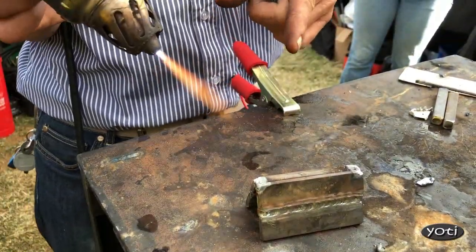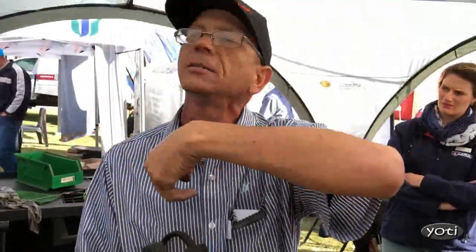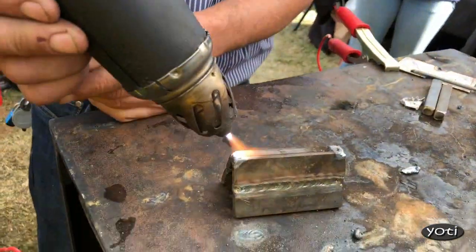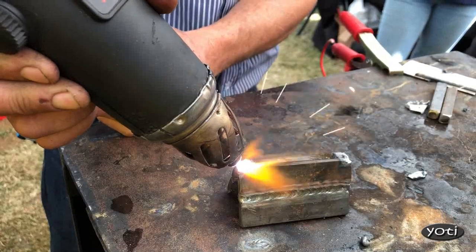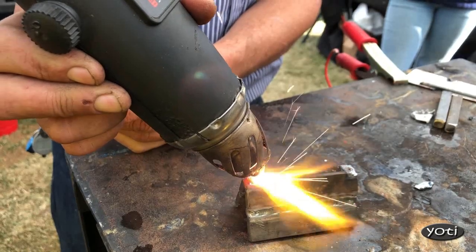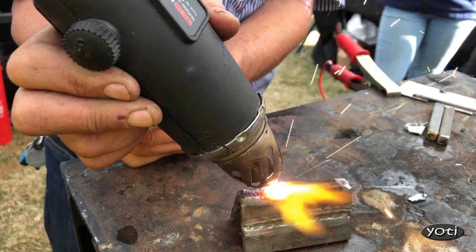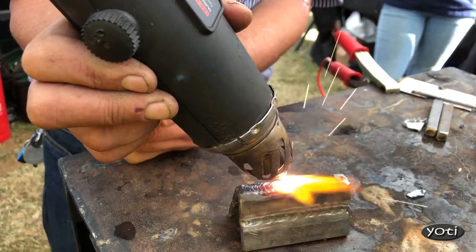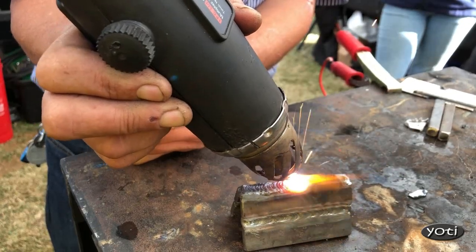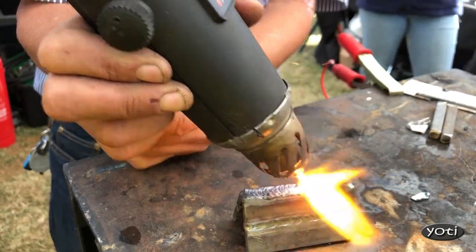If you cut your corners so that it's nice together, you can build a tank of 10 kilometers by 10 kilometers by 10 kilometers high without using one filler rod or one welding rod. Look at this. Get my puddle and there I go. Penetration all depends on myself, because the longer I keep it there, the deeper the plasma will go in and it will melt until it goes right through eventually. So I am welding or melting the metals together at 8000 degrees Celsius.